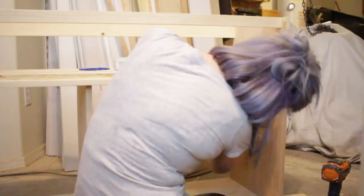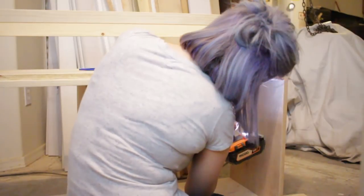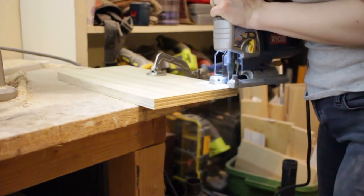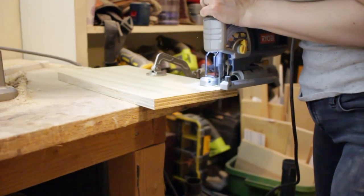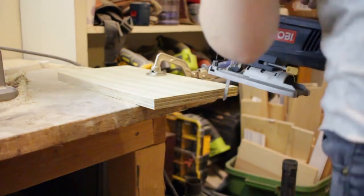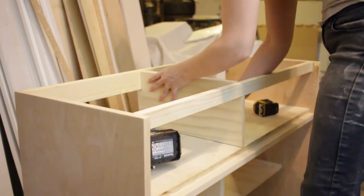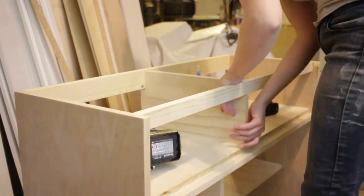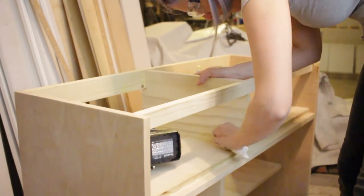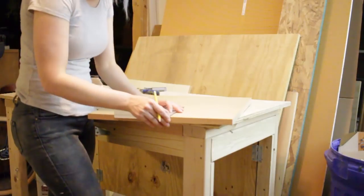I connected the 1x2 face frame to the cabinet using pocket holes and glue. The horizontal shelf has a divider separating the speaker area from the rest of the audio components. Before installing the divider, I had to notch the corners using my least favorite saw — the jigsaw. Once the corners were notched, I applied glue to the edges and dropped the divider in place. Since I was going to stain this project, I was very careful about wiping off any glue squeeze-out. To hold the divider in place, I used 23-gauge pins as well as screws driven up from the bottom.